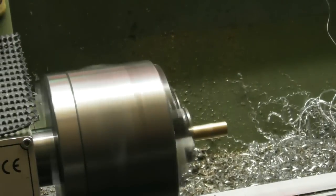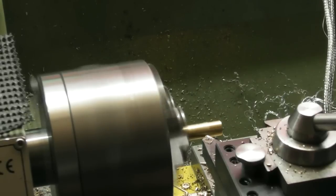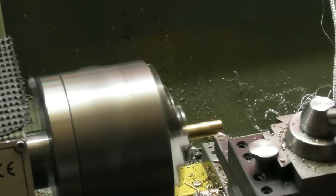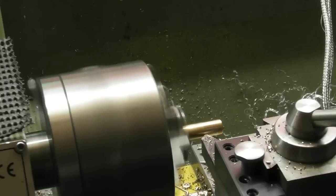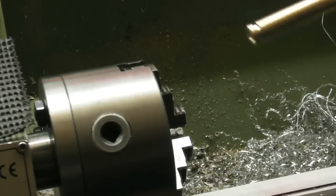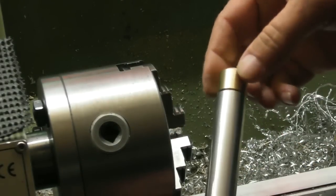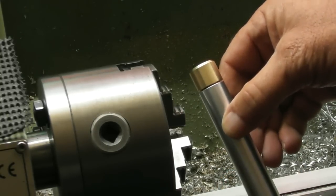Pretty straightforward - I put the piston up in the chuck, it's running fairly true. I'll just come in there and touch off on this bit, just giving it a tickle. That runs out into nothing. Give that a try - yeah, that goes up in there. I'll whip it out of the chuck and put the end cap back on. There we go - it was next to nothing but there we are. As you can see, when that bottoms out there's just a slight gap so I know it's bottoming out and giving me full compression.